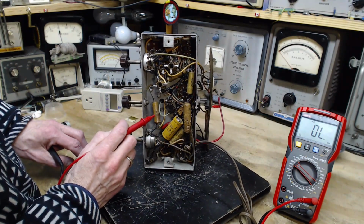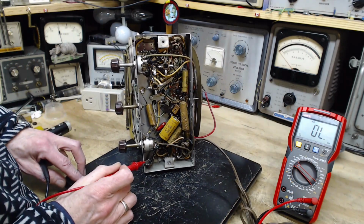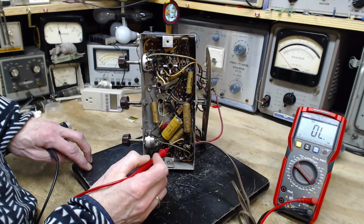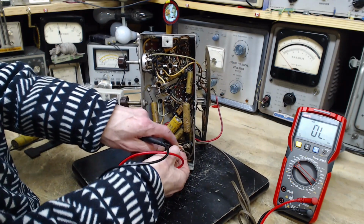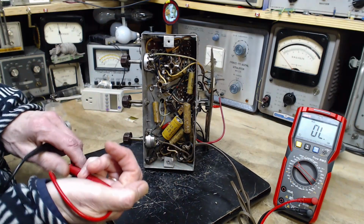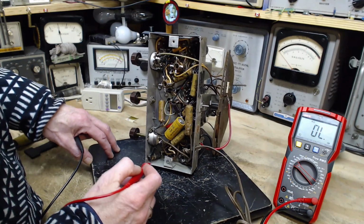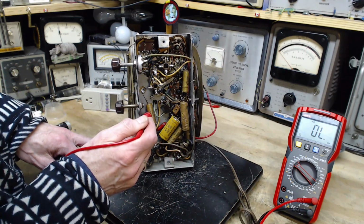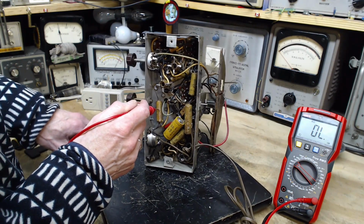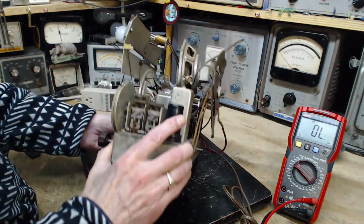So along with there being one capacitor, there's often a resistor. Here's these 2 resistors that caught my fancy there. Okay, this is one of the filter leads here. I see nothing else anywhere that is tied to ground except this spot with this capacitor tied to the chassis. I don't want to say ground. Let's just look on top here.